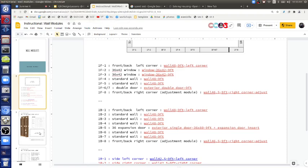So real quickly, we were asking about the purpose of the design. Modular, manufacturable either on-site or off-site, and interlocking, where these things interlock and allow for stacking of multiple floors. Modular, open source, expandable, buildable at the lowest possible cost. Those are high-level principles, but they're very well baked into this. We're doing Lego blocks for panels, and we want them to snap together in a way that works and takes into account the tolerance of the variation of wood.